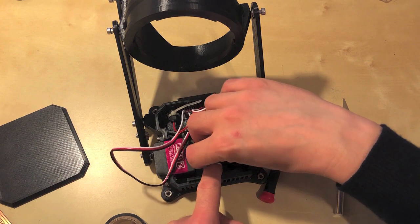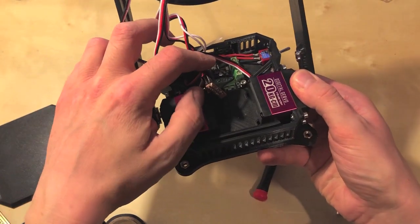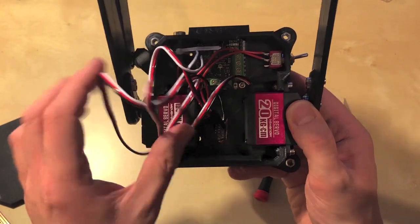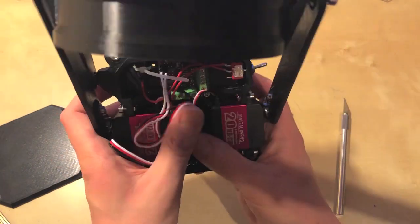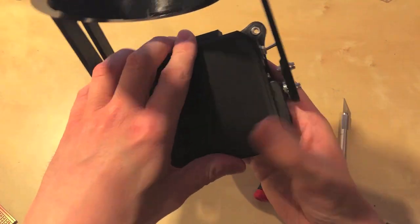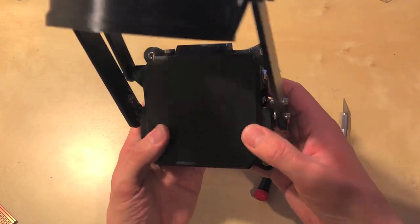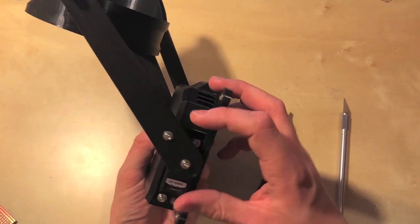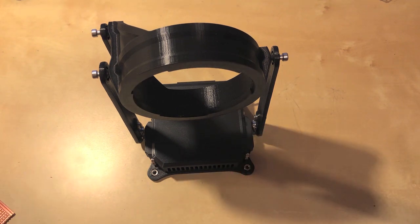These servo connectors plug in here. One last thing to be aware of: if your servos have metal bases, make sure these exposed pins don't end up touching anything metal. These are plastic-based servos so it's less of a concern, but tape is your friend — wrap it around to make sure everything is insulated. Then you can close everything up, power it on, and the visible difference on the outside is this switch here to turn the servos on and off while the Arduino stays powered. That's the power user mod for the OSR2 — I hope that was useful!